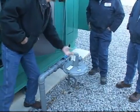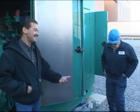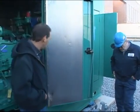You do want to make sure that vent stays clear. That's an area you want to make sure the screen stays in there. It's not uncommon to have bees or wasps — if they get inside there they block it off and it doesn't work. So it's just something you want to keep a look at.